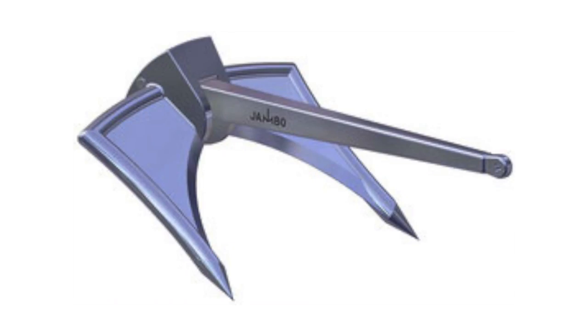The next contentious issue is whether to have a swivel or not. Well, our anchor is a Jumbo, which is a German anchor, and the manufacturer supplies it with a swivel. So we do use the swivel. A lot of people tend to think that the swivel is dangerous and they can break, and that has been documented. So you've really got to research whether you think you should have a swivel or not. We have the swivel because the manufacturer provides the anchor with the swivel.